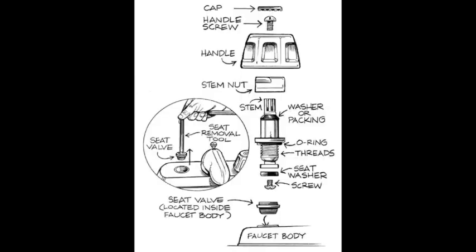Step number 4: if that doesn't work, try the drain snake, which is basically a hand crank and cable. You snake it down the drain opening, then turn the crank. It takes some finesse. Apartment dwellers, if your sink and your neighbor's drain into the same pipe, you might snake through to the sink on the other side of the wall. Careful. Step number 5: still not unclogged? Call the plumber.